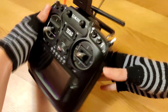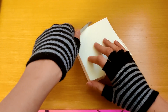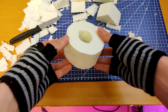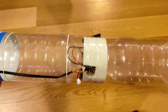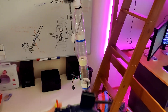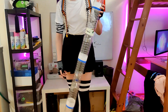Here's the remote control I'll use. To mount the electronics, I used a piece of XPS foam which I cut into the shape of a circle with a hole through it, so it fits onto the fairing of the rocket, and then I mounted the electronics onto it. To deploy the parachute, I flip the red switch on the remote and it releases. Now that the rocket's finished, all we need to do is go out and test it, and hope that it works.